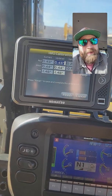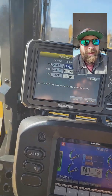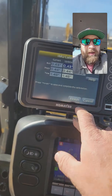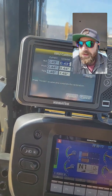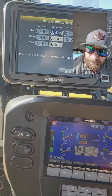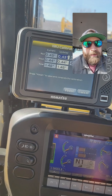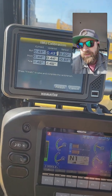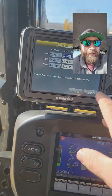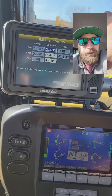I'm going to take a measurement facing west, spin around east, line up in the same position, and hit calibrate again. Basically what it does is average out the difference in the sensors. I always try to do one east and west and one north and south — that's ideal. Then I do a check afterward where I don't actually calibrate, just verify everything's matching up. Machine is at idle, not moving.